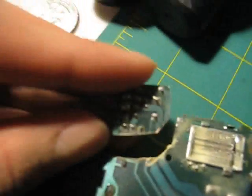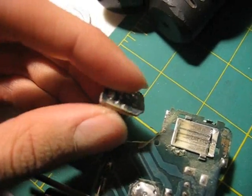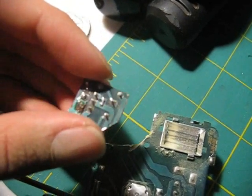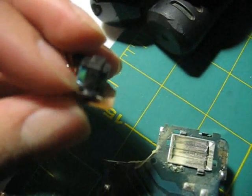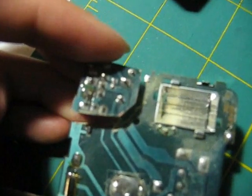And when you cut this, just make sure that you cut it underneath these three leads at the bottom, which is the transistor. And make sure that you cut it on the right side of this metal piece right here that's connected to this diode, like that.